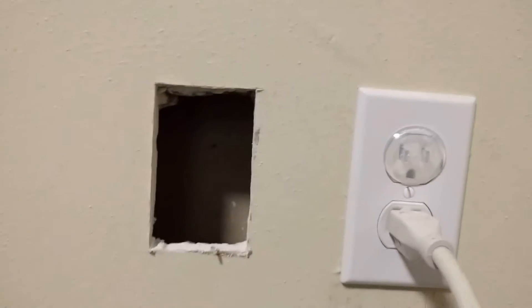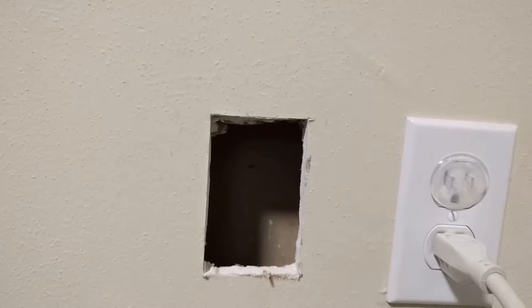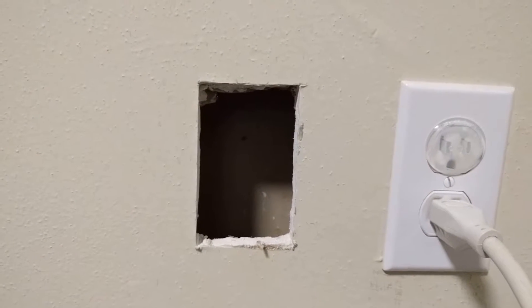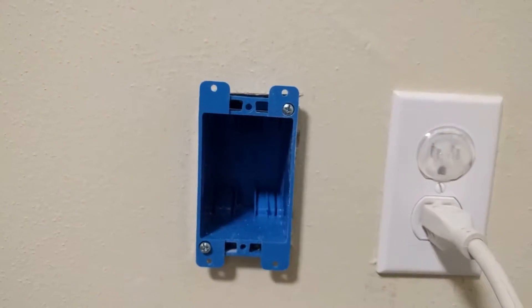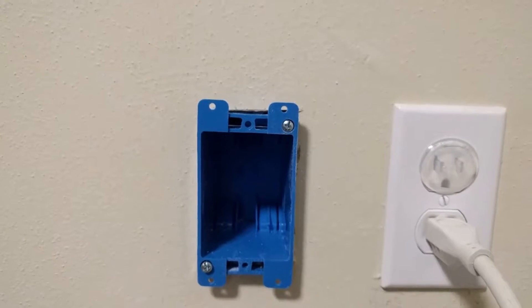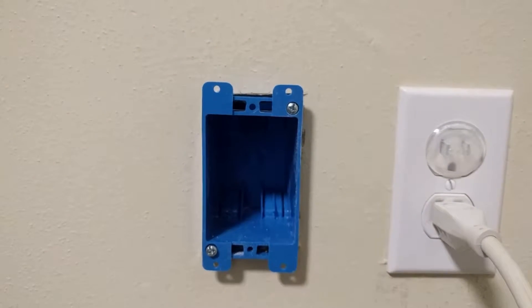That's fine because most everything attached to it is Ethernet connected. The first thing I've done is — since there was no spot for a cable box — I've measured my wall so that I know I can fish some cable up through here from underneath in the basement. I've cut out my box, or my hole for my box, and that's going to slip right in there. But the next thing I need to do is go downstairs, measure, and drill a hole so I can snake my wire up through here.